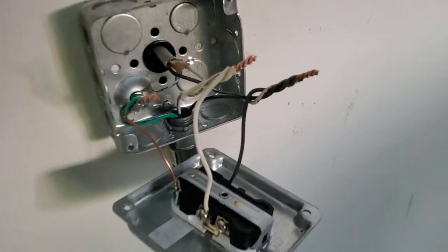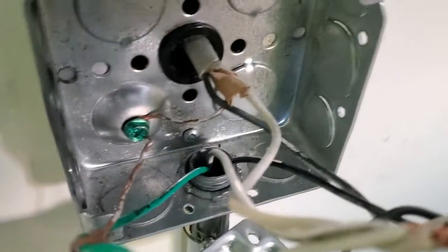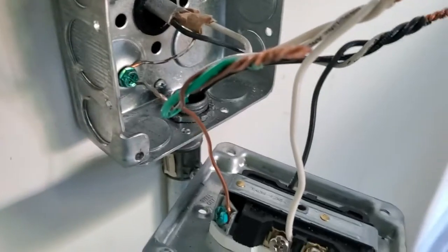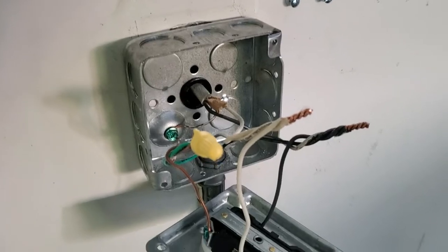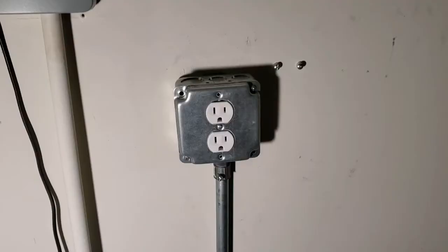Here we are, we have everything wired up. When you twist your wires together, you want to make sure they're nice and clean like you see here - good contact on everything. We have the ground coming out, with that screw, and the ground wire connected to the ground on the box, then coming into the pigtail. When you put your wire nuts on, make sure you're using the right size wire nuts - only certain wire nuts are rated for certain gauge wires and the amount of wires you have. I'll put these wire nuts on, tighten this box up, cut the next piece, and move along.